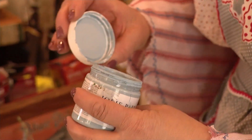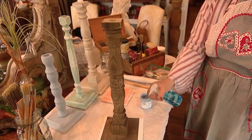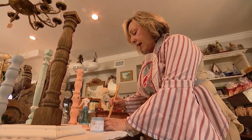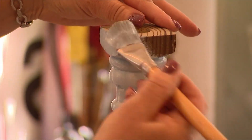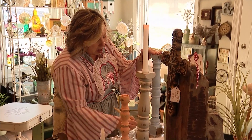Next, we paint. Sue is using chalk paint. Then we distress the wood to get this look. Spray on some water to help thin the paint out, then start painting. Thin layers — one thing about chalk paint, it is so forgiving. If you make a mistake, you just paint over again. Leave about two hours in between coats. You only need two coats.